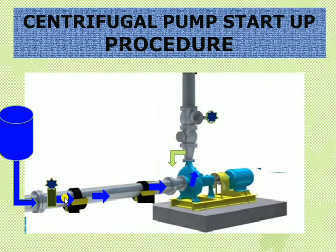If the discharge is also open during startup, the liquid lined up will get pushed out, requiring even more energy — and the motor, already drawing high current, can trip the pump. To avoid this, the discharge should be kept in closed or crack-open condition. In some cases, where the motor and pump are designed with higher capacity, it is acceptable to keep the discharge 100% open and there will be no tripping issue — this applies when pumps are on auto-start with discharge automatically open.